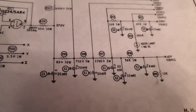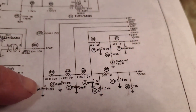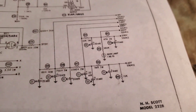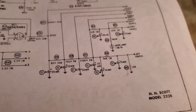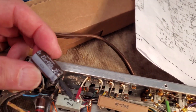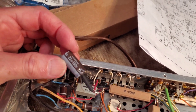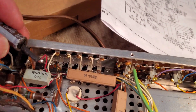Down here, C1, C2, C3 — each one of these little 20 microfarad values represents one of the internal capacitors that was within a can like that. So we're going to try replacing them. I've gone ahead and added the first one here. I don't really have 20 microfarad, but I'm going ahead and using a 22, which is close enough, 450 volt rated.